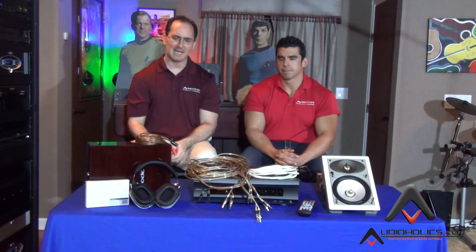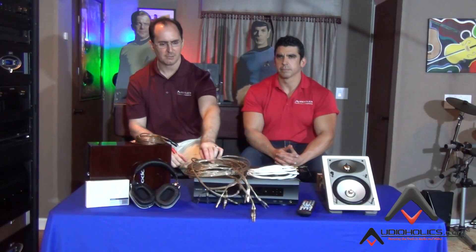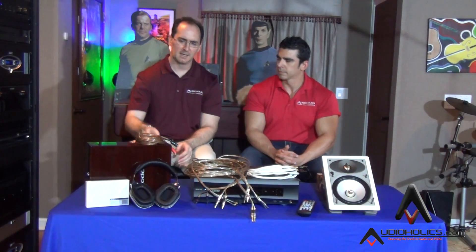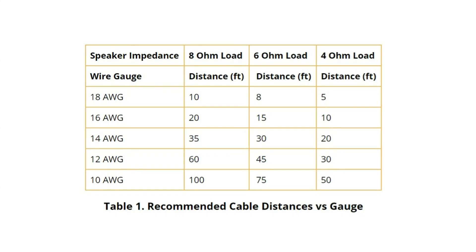Cable is so cheap these days. I would never recommend less than 12 gauge for high fidelity — I wouldn't go to 18 gauge. This 16-gauge cable here is pretty thin junky stuff; it serves its purpose for short distances. This is 12 gauge, and I personally use 10 gauge, which has about 3 milliohms per foot of loop resistance — really low. My favorite cable is 14-4 because it's four-conductor 14 gauge. When you parallel them up, it gives you an equivalent gauge of 11, close to the resistance of a 10-gauge cable, and you've got a redundant pair of connectors in case one breaks. We always recommend 14-4 if you can. It's a little harder to work with and terminate, but for high fidelity, go with the 14-4.